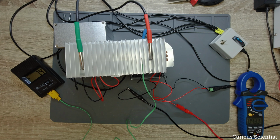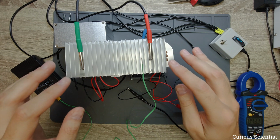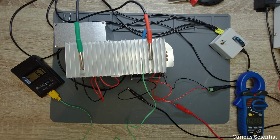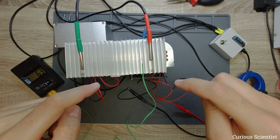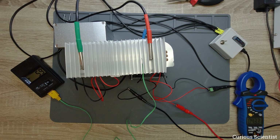And now, of course, this is still considered a semi-closed system, because the only airflow here is the fan-created airflow and the airflow created by me talking and waving my hands. But the contact between the heatsink and the environment is quite poor, which means the heat being pumped from the heatsink to the hot side is quite low. So therefore this can become relatively cold, because QC is low and the DT can go higher.